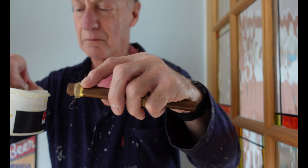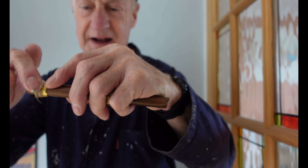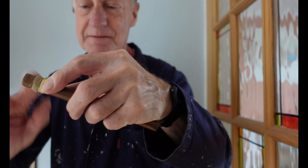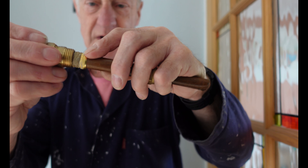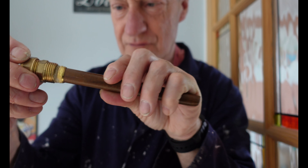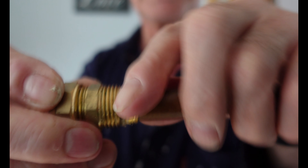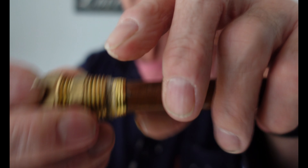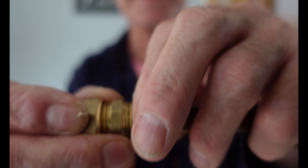Then all we're going to do is put this lovely Boss White on — people either love or hate it, it's a real mixed bag. Put a little bit on the finger and go around the hemp. It kind of makes the hemp really moist and just right for the job. I've taken the fitting off just to show you, but that would be it — you can see the hemp right in there looking really good. Don't put too much on, otherwise you won't get the nut started back on.